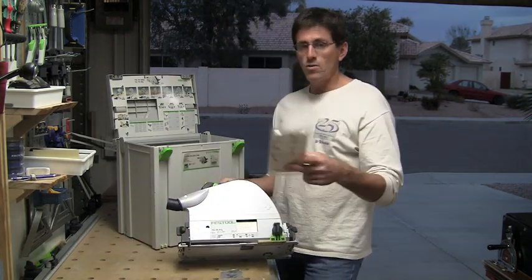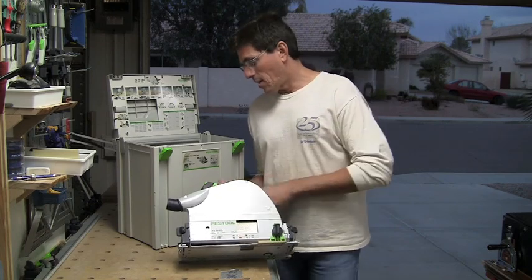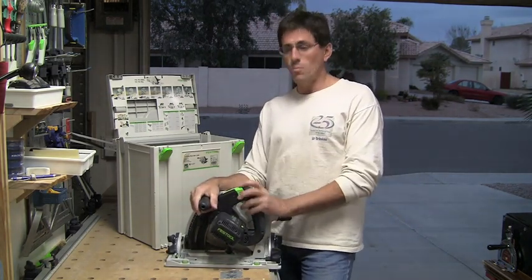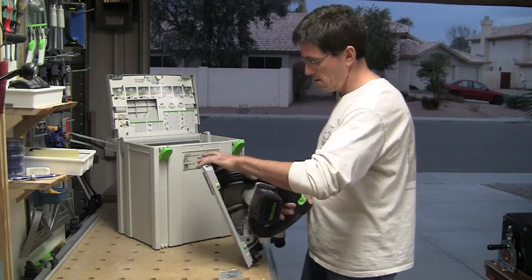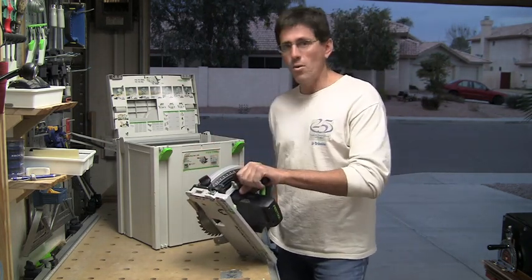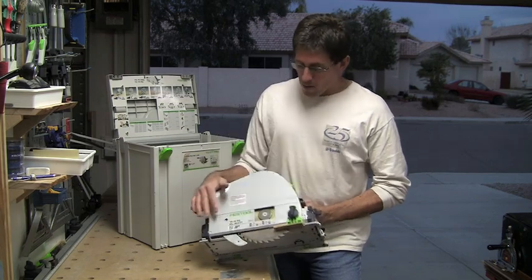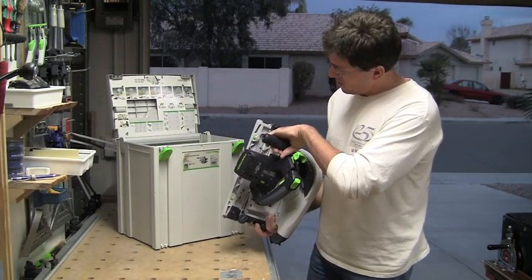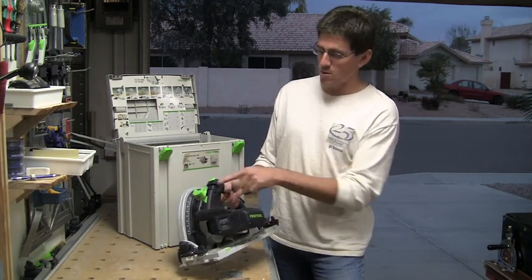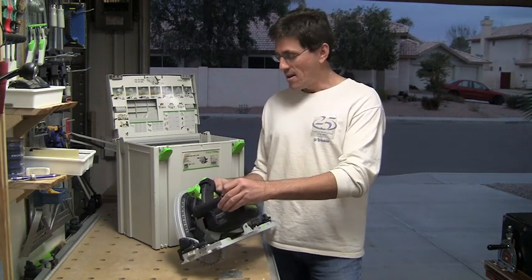These splinter guards, of course, are consumable, so you're going to get them in nice little five packs. Anything that's green is an adjustable or consumable item. The other adjustments on this saw would be from this side. This is a fast-fix mechanism for switching out the blade — you're going to plunge the saw, set the depth down low, then pull the fast-fix mechanism, and that's going to hold the saw in place so you can conveniently access the arbor nut and replace the blade. The Allen wrench you need for this is stored on board for convenience. The fast-fix mechanism also takes out the power switch — you can no longer engage the power switch while it's locked in the open position, so you couldn't use it like a traditional circular saw with the blade sticking out at all times.